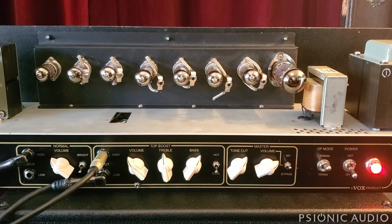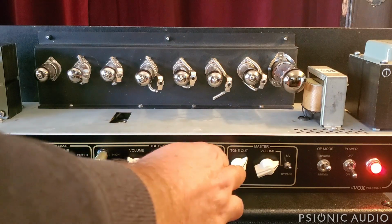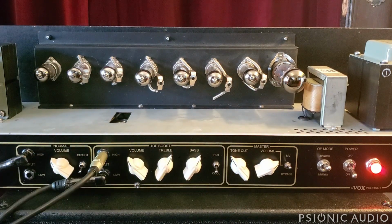Once you get into the price point of the TBX or hand-wired, I think it's certainly worthwhile doing. And it's also much easier to do on those amps. I would recommend to anyone to have them wired out of phase if they can afford the mod. It just lets you get all those sounds that the JMIs do that people don't know about, and lets you have a Fender Twin hidden inside your AC30.